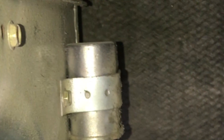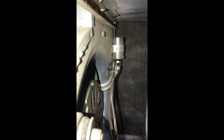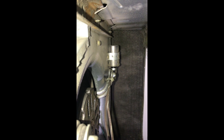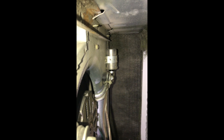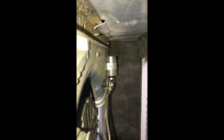On the right side is the blower motor — here it is right here. Just above the motor is our capacitor. Be careful when removing the capacitor as it holds an electrical charge. The function of a capacitor is to store and discharge energy, providing a steady supply of electricity to the fan motor, therefore helping the blower move hot air through your system.